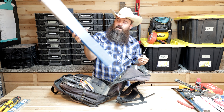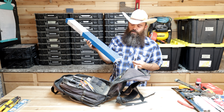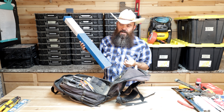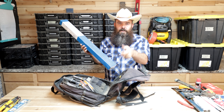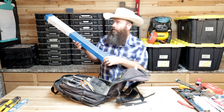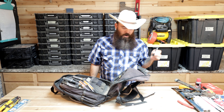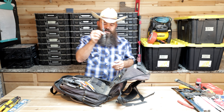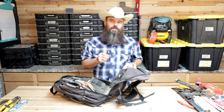A pair of dykes. Tiny little crowbar — this works; 90% of the time this little guy is going to get you by just fine, though I do have a larger one for exterior work like decks and roofs. Just a little bit of silicone in there. Here we have the one chisel I'm keeping lately — this is mostly for doing door frames, anywhere you've got your strike plates on door frames or on the door itself. I oftentimes find myself needing one to tidy everything up and make sure everything fits and latches properly.